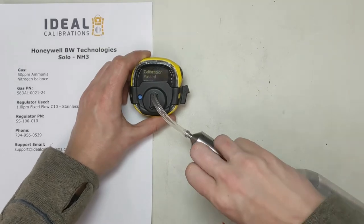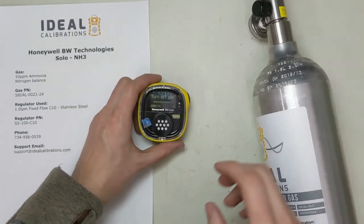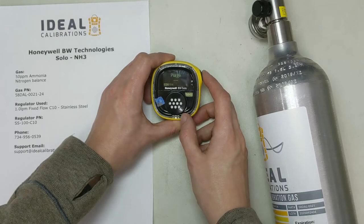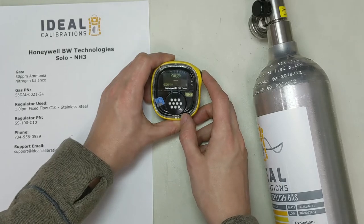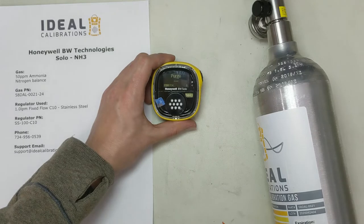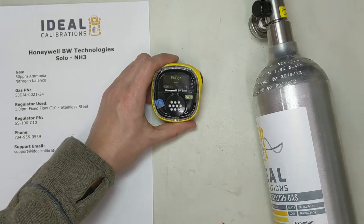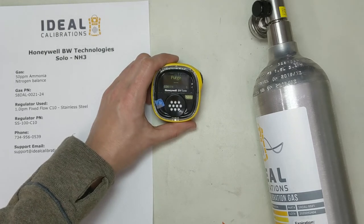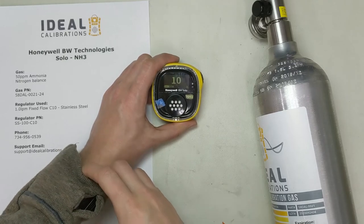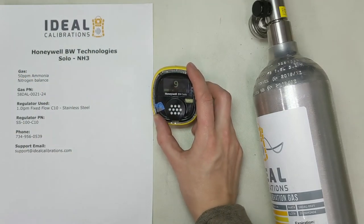Complete 50 — that's just what we want. So we're going to turn our gas off now, pop the hood, and put that aside. Now it says turn off gas, next calibration in 179 days. And it's saying purge — what it's doing right now is the level is slowly coming down. They have a timer built in so it doesn't go into alarm once you pull the gas off and the sensor is on its way down. This will take just a little bit of time — you want to wait for it to finish. Now it's showing a reading coming down. There's a bump mode in this — I'm going to show you how to do a bump test on this unit for your daily bump.